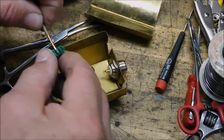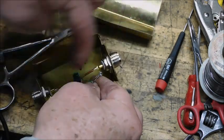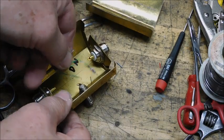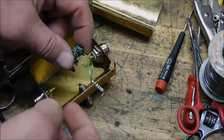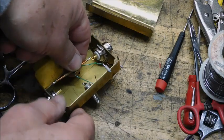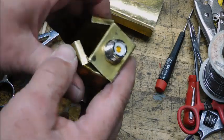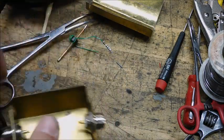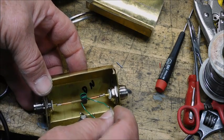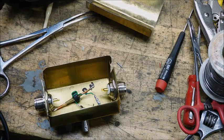What we'll do is run that toroid like that. We'll sample off from the throughput RF and go straight to the BNC connector. There's only five turns of 23 gauge wire, so that should be good enough. When I'm done I'll finish soldering up all these seams and close this up into one package. That's how I make an RF sniffer to be able to not put a load on your equipment when you're testing it.